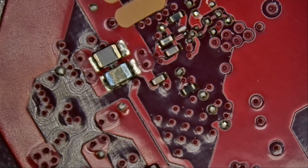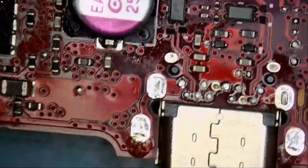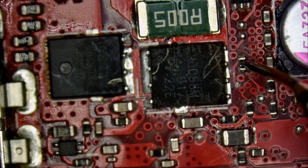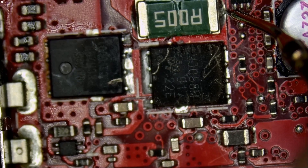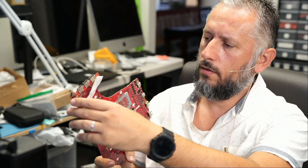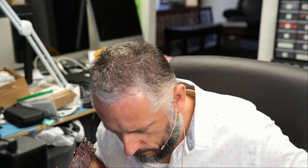And we're done. We're going to measure at the drain of the MOSFET that the customer removed, make sure we do not have a short here. We do not have a short anymore — I'm reading 0.41. I think this ASUS laptop is fixed. I'm going to hand the board over to Big Boss to assemble and test. Who needs the sticker, right? Hanging by a thread. Let's check on Big Boss — almost done with the reassembly.